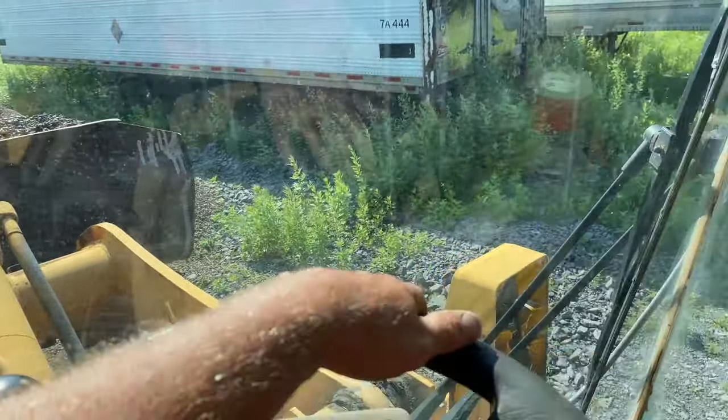It's just a simple ranch house, guys. Really cost-effective way to build here. So that's how we're going to do it. Heated slab. That's what we're doing. I'm in the skidster, Kevin the Kubota, putting the foam around the edge here, and then I'm just dumping this gravel up against it. I gotta cut it. Got Big Biscuit over there leveling it out. So we're doing a frost protected slab.